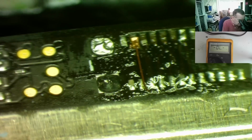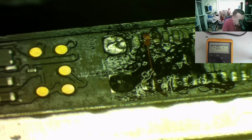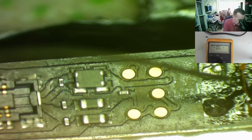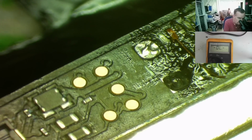Okay, that's almost in place. I think just slightly outwards from there. That way a little bit, yeah. And then I'll just solder the tail end on. This might be easier with a smaller tip than the one I normally work with, but this may actually do it. I'm going to get a bit of solder on the end of the tip. If it's too big, I'll use something else this time. I'll now rotate it a little bit where I can work on it.